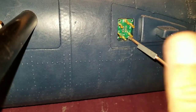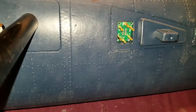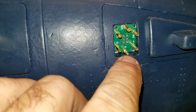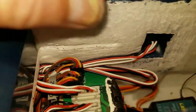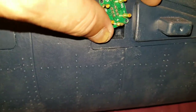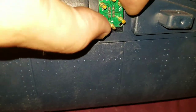Take this board out. The board is actually in here when you get it brand new kind of tight. Don't pull or squeeze on any of these little connections, especially the pin on the bottom. You don't want to depress any of those tangs because they help make the connection. Reach in from the back side and push it out. Keep mindful of the orientation — the pins are on the bottom and the socket is on top.